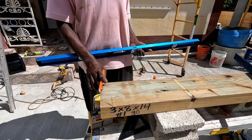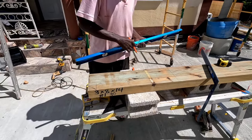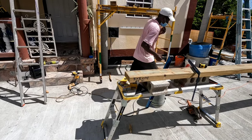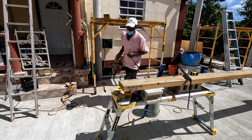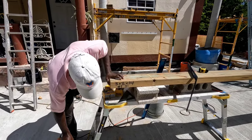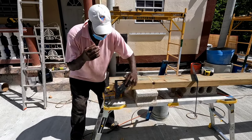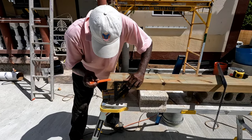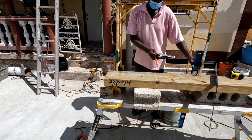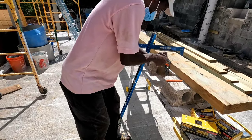This is what the lock is about — I have to cut this, cut that, and then cut straight in the center. If you're looking carefully, I'll give you a small practical demonstration. I take my saw and carry the mark down to be square, so that when I saw it I can have the lock square. Basically the same thing on one point and the same thing on the other point.